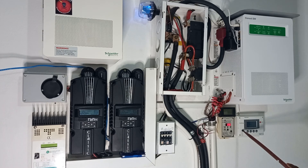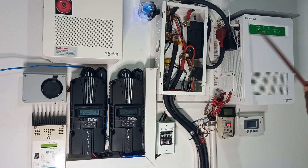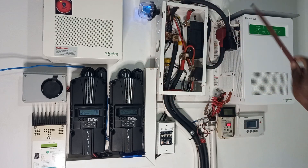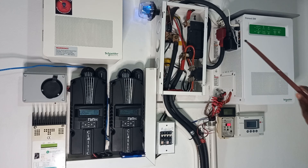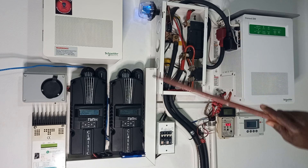Here we have the SCP — the System Control Panel — that we'll use to configure these inverters. They are already configured, but the SCP will also be part of the Xanbus network, connected here via Cat5 cable. We'll probably need to terminate or make our own cable — one from here to the other port, and then from that port to the SCP, terminating both ends. We'll also be mounting another temperature sensor on the second unit. Note that the stacking ports are not enabled on these units.